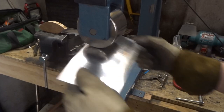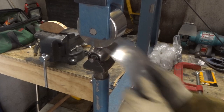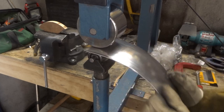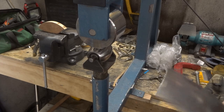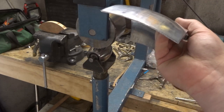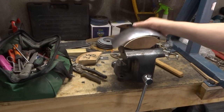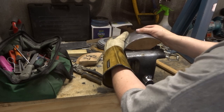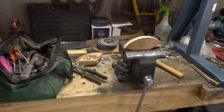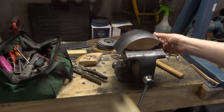I'm not going to the edges, partly because I don't want the edges to stretch. So I've got a reasonable curve that way and a reasonable curve that way — they're similar. The next thing is to see how that fits on my template. That's pretty typical, so give it a bit of a bend. It's closer but there's a gap at the end, so now I just put it over my knee — basically bent it over my knee. How's that look? Absolutely bang on.